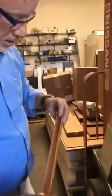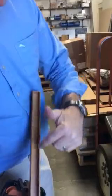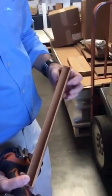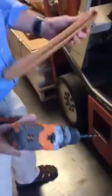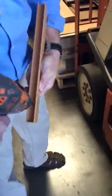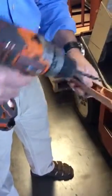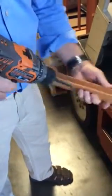So inside the H-channel, if you can see this, there are some die marks on the top edge of it. I'm going to drill out two of those holes — the top hole and then the last hole — using a 5/16-inch drill bit, lining it up approximately in the center. And then I drill out my last one.